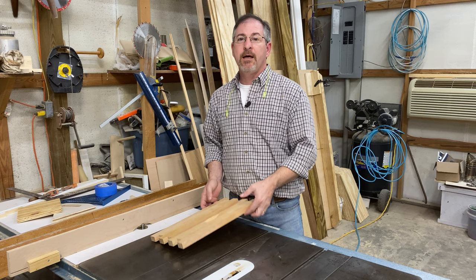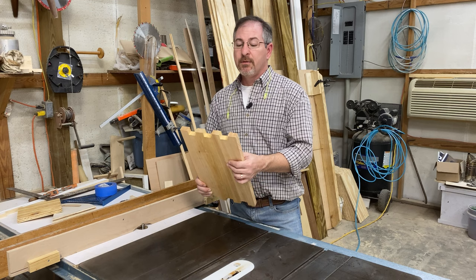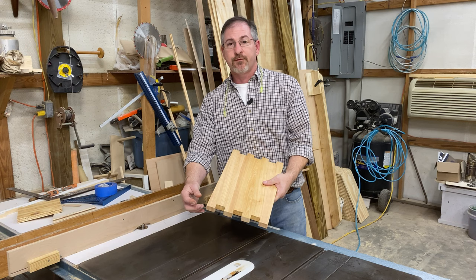We'll need a 3/8 by 5/8 rabbet on the top edge of our fronts and backs to receive our frames. I can do that with the dado blade on our 7/8 inch box joint construction and for our rabbet joint construction. But for our inch and 3/8 box joint, I'll do that with a router mounted under the table. I've set up a sacrificial fence with a bump stop on both ends that'll stop our cut 3/4 inch from the end of both ends of our board.